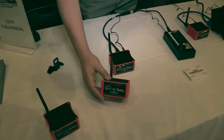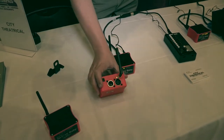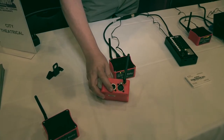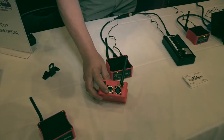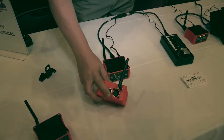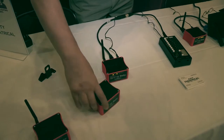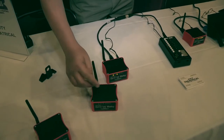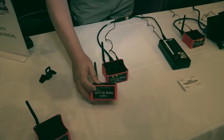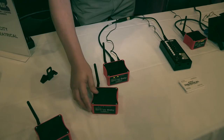Show Baby is entirely plug and play. The only user interface is which side you plug in. When you plug DMX into it, you'll see there's a little switch under the DMX in, which lets it know it's a transmitter — otherwise it's always a receiver. Each of these little orange boxes is a transceiver; it can be either a transmitter or a receiver depending on how you plug it in. There are indicators on the front that show DMX present, received, transmit, and a four-bar signal strength meter.